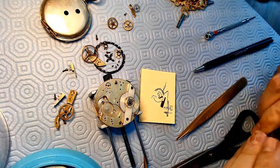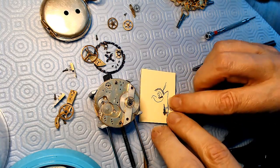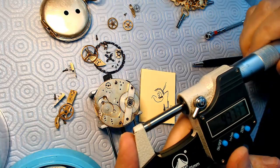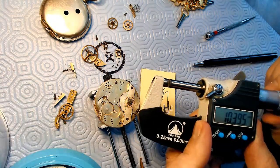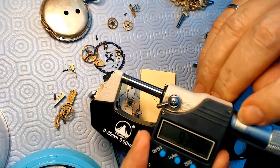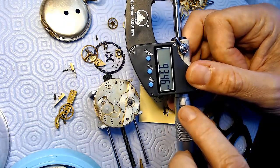If I was really brave I could get out my micrometer and actually measure that piece of metal. So I'm going to pause for a second and get out my micrometer. This is a digital micrometer made in China. You squeeze the part in here and the reading is right here in millimeters. You turn this side and it clicks so you don't push it anymore. I adjusted this so it's hitting zero right on the money, which is good.